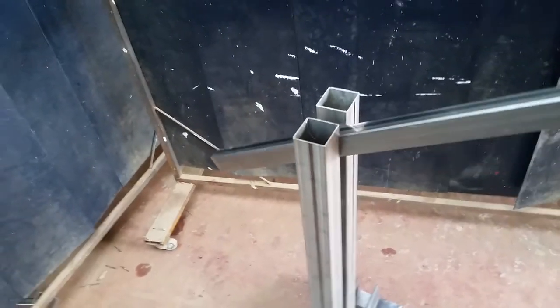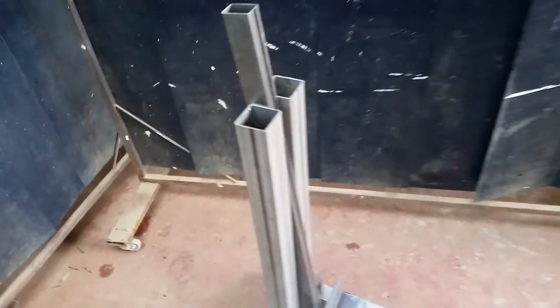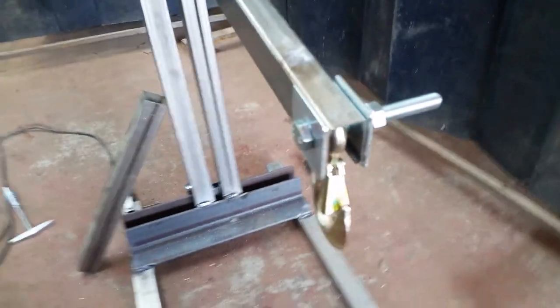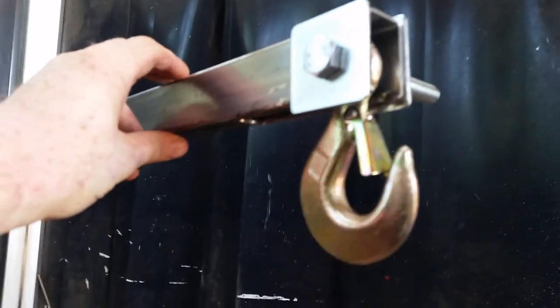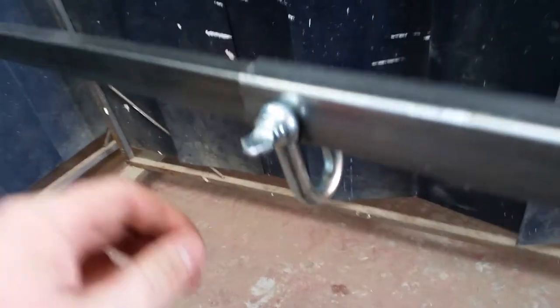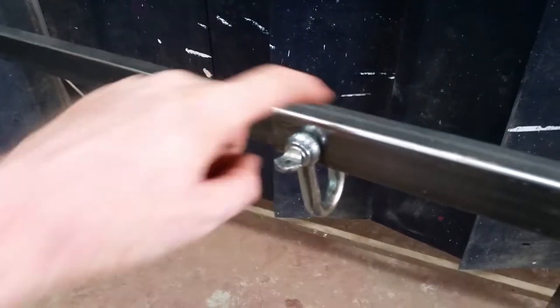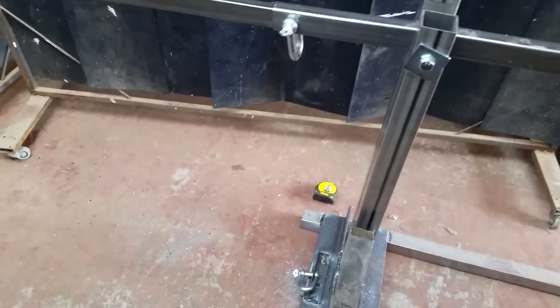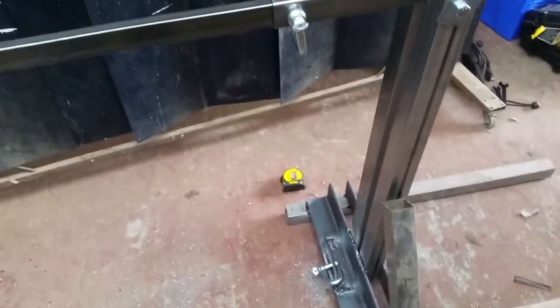So that's the basic stand made. I've now slotted in a piece here and I need to put a bolt through to make it do its thing. I've made up a hook on the front just by slotting that — it's slotted so that as the hook comes back it can go inside the tube a bit, but it's still strong enough for the weight I'm talking about. I've got a bolt through the tubes and used a shackle as a method of connecting this piece into that piece, which gives me the extension. I've got a shackle down here as well — I can put a puller on or a piece of rope to lock it off if I want to hold it there.